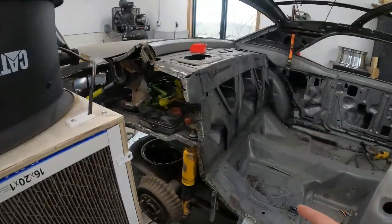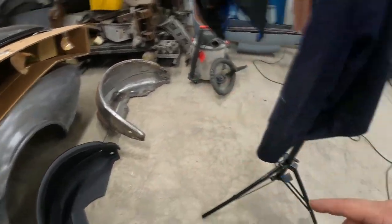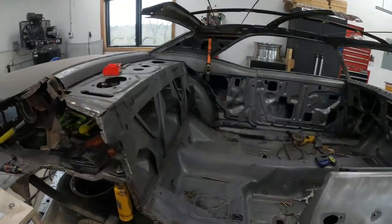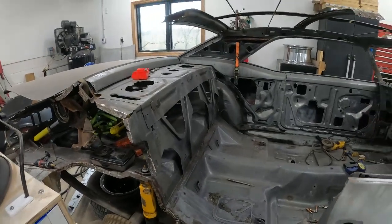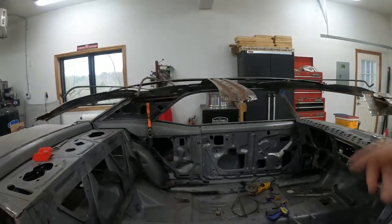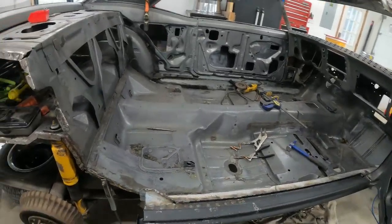The next video you're gonna see me work on installing a new wheel tub. I have to weld both of these halves together, get them fit up in the car, and then we can work on getting the quarter structure in here, get all that stuff welded together, and then it's just a matter of getting the quarter on, the roof skin, fixing the gutters, treating all this rust, and fixing a little bit of rust on that side. So still a lot of work to go, but that was one of the big steps.